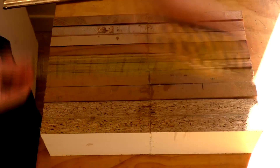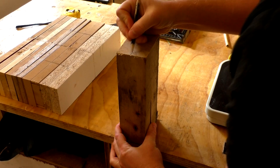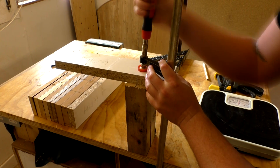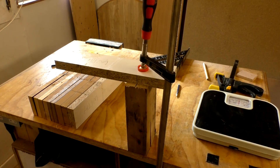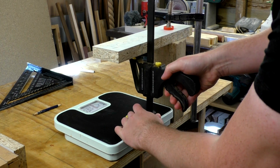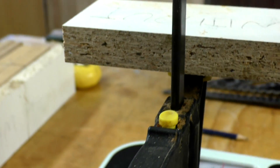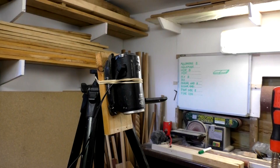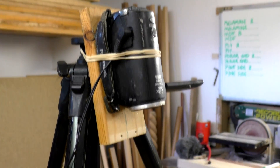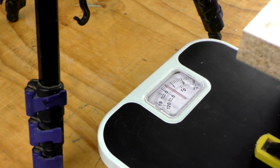I actually ended up leaving them to dry overnight — about 20 hours in total. The next day, I marked up some centre points on both sides of the glue joint. These would serve as reference marks to align onto the top of a block, which I could then clamp to my workbench top. I then used my bathroom scales and a squeeze clamp reconfigured as a spreader clamp to apply force to the joints, aligning the bar of the spreader clamp to the centre mark on the board to keep things as fair as possible. I rigged up a second camera to film the results from the bathroom scales, to accurately determine the peak force applied at the breaking point for each example.